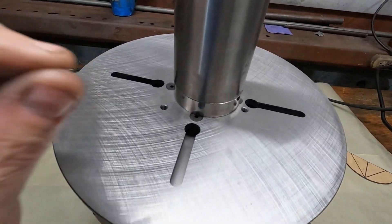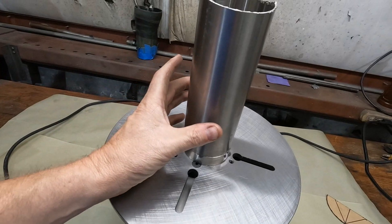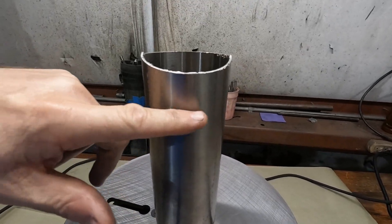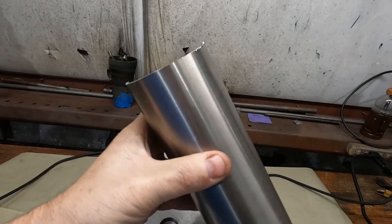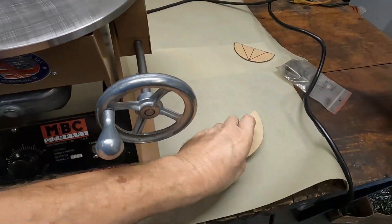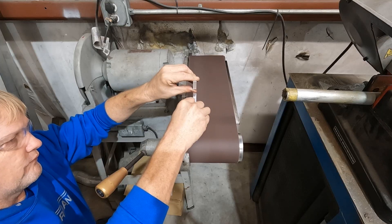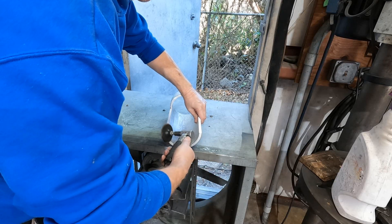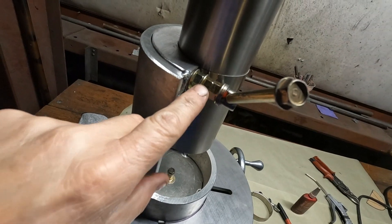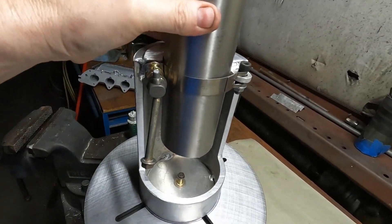It's great — you can basically hold your torch, and that's how you get those continuous welds. I bought this last year, and the idea is to start making pipes. The brace, or fixture I'm making, is to hold a pipe so the welding point is level with the horizon. If the pipe bends, the fixture lets it hang out the side. I want to add a spring so you just loosen it, it opens up, and you can take the pipe out.